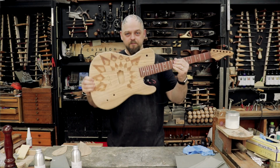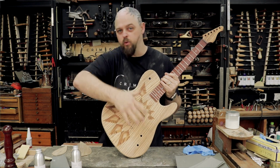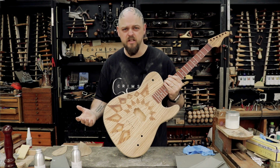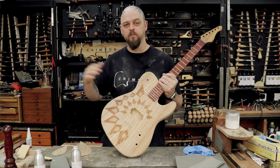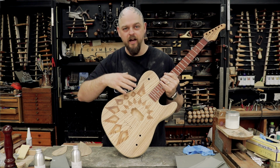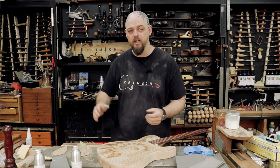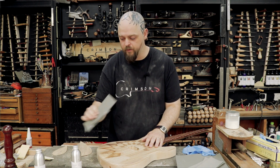Now, this guitar, there is a slight difficulty in that I have wood and I have the epoxy filled star. Let's go with star. And we need to polish that star at the same time as applying finish. I can't go through to 3,000-4,000 grit on here and get it. I don't want to. What I'm going to do is the standard process actually for applying guitar finishing oil, which is rub it in with wet and dry paper.